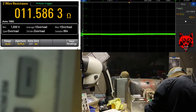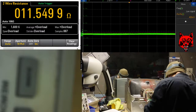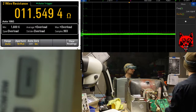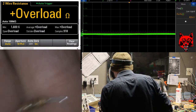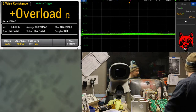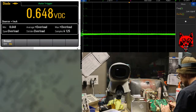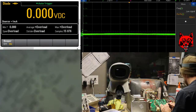I'm going to take this guy out of circuit. This heat sinked transistor. Oh, here's that guy I was telling you about. It reads 12 ohm. See how burnt that is? It's got some previous damage. I'm just going to make sure there's not an open here. I wasn't reading a different part of the circuit. Getting fooled. Looks good.